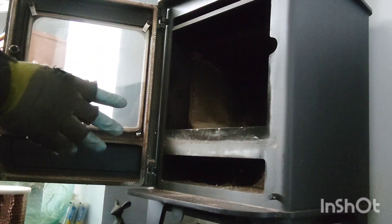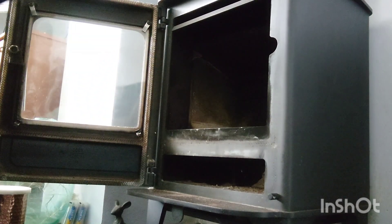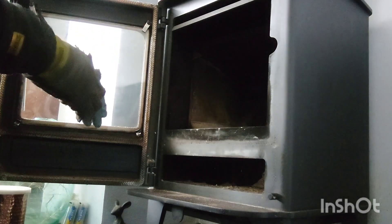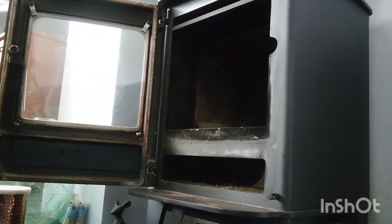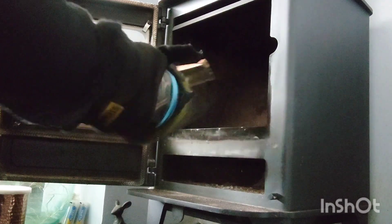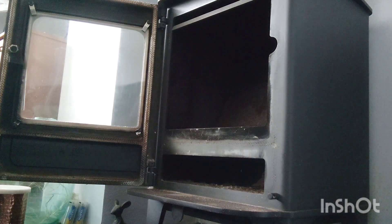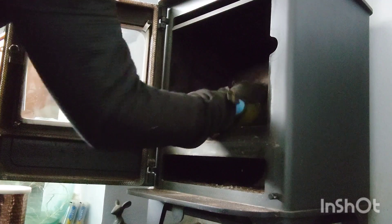If you're not going to use them, I'd strongly recommend getting a rainwater cover top — either a spiromatic will do the job, or a rainwater cover top. You can seal down the sides where the water's been coming down. See that brick that just fell off from the corner? You just take the bricks out like that, and then you can drop the baffle plate down. As you can see, the water's been coming down here — you can see all the rust on the top where the baffle plate's been sitting.